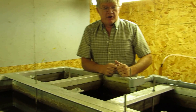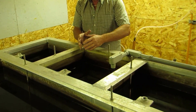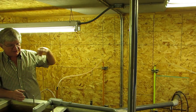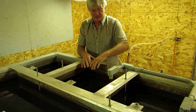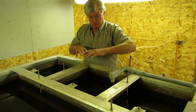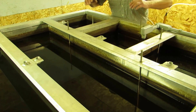There are several compartments here — the water enters into this center compartment. From there there are baffles and ports in the lower portion, and this is designed to slow the water down. The water coming through the pipe enters very quickly, but as it enters this tank it slows down, rises up, having already been mixed, and then from this tank it goes out to the two side tanks which slows the water further, and then from those two smaller tanks to a much larger tank, which slows the water down yet again. This slowing allows for the coagulation-flocculation process so that clumps of organic matter, color, and other impurities in the water can be removed.